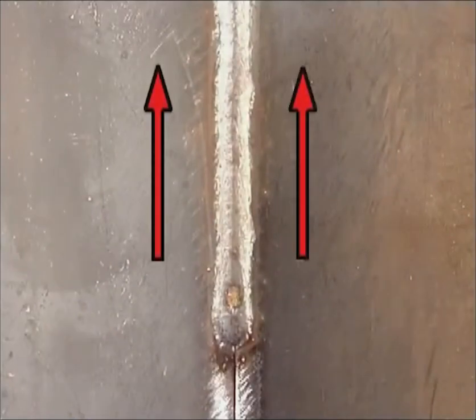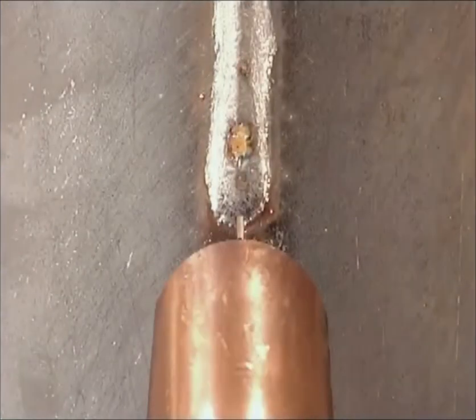Vertical welds with short circuit gas metal arc welding are made downhill or downhand. Heat rises, so you will be welding away from the heat, which keeps the base metal cooler. Angle the gun up a little using the heat of the arc to help hold the puddle up. You can either run straight down or use a slight side-to-side movement. Move fast enough to stay ahead of the molten metal, keeping the wire on the leading edge for penetration and watching the sides to keep the weld straight. If you can't travel fast enough and stay in control, you may need to turn down the wire speed and voltage so the filler metal isn't quite so fluid.